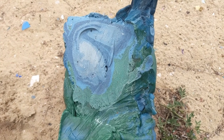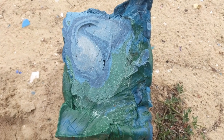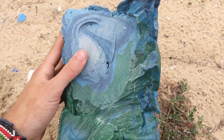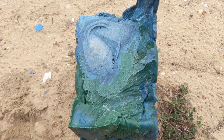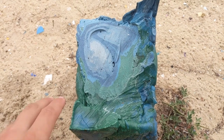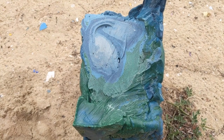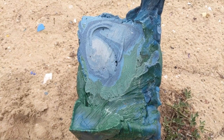And in the previous building of the prototype, it was found that the tools were getting dull very quickly. And it was thought that it was because of the actual plastic itself. But in fact, there is a good chance it is because of the little bits of metal, glass, and shell inside the plastic. And one solution to prevent this is when the plastic is shredded, just to put it in water, and all the things that are not HDPE will hopefully sink to the bottom and cause much less wear on the tools as well. And these things can be cut with traditional saws, drill bits, and blades without them getting dull as well. So that's one useful finding.